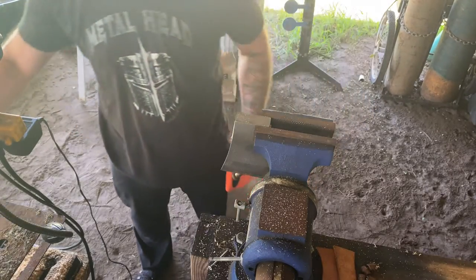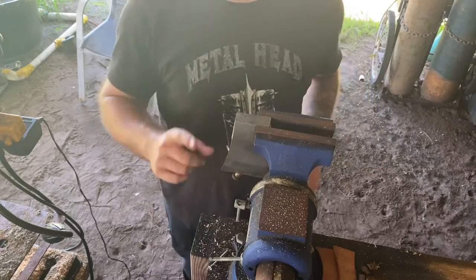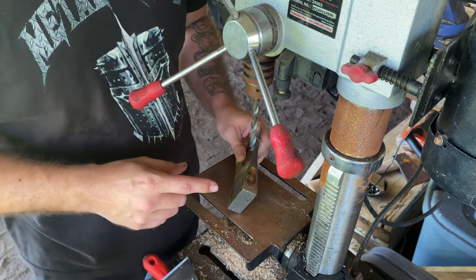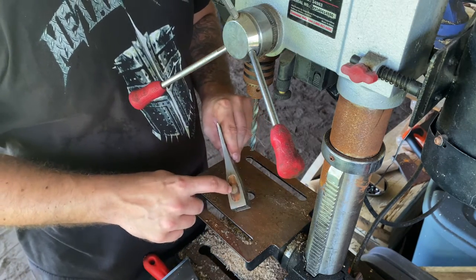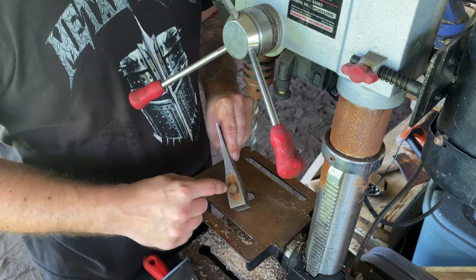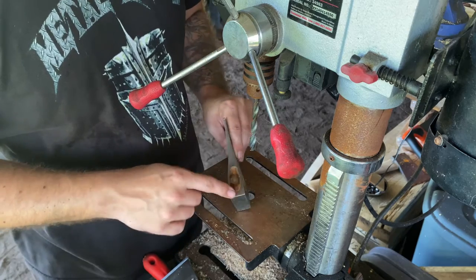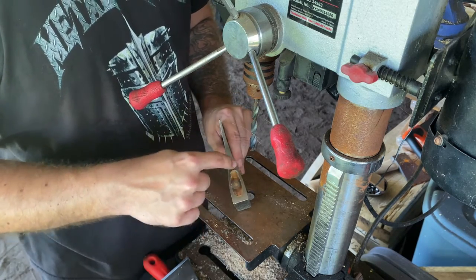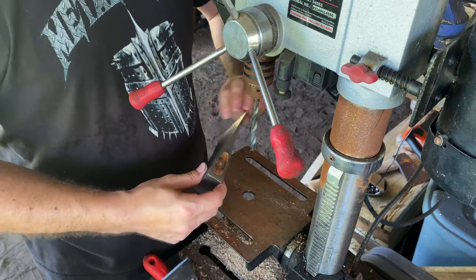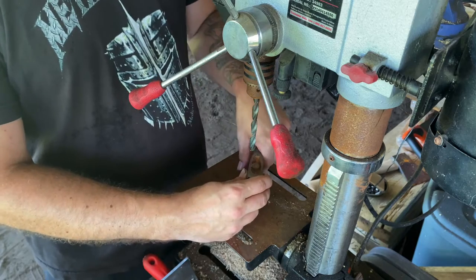Nice clean cut. Now we've got to drill it out. For drilling them out, we've got to get this wedge — there are two wedges. There's a wooden wedge, you can't really see it, it sort of blends in on this one. And there's a steel wedge — this is a circular wedge. I don't like these; I'll talk about that more later when we wedge the handle. With this drill press I'm going to drill a hole here, flip it over, and go straight down the middle to try to get this wood out. Most of the time this is tremendously annoying, but we'll hope it goes a little bit better today.